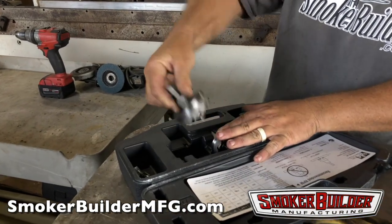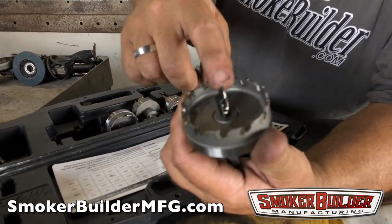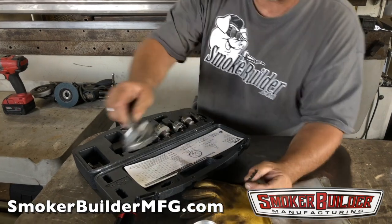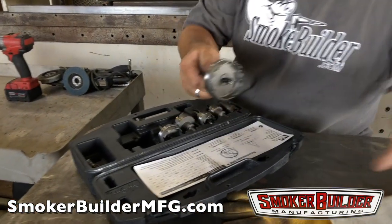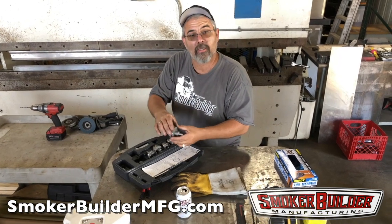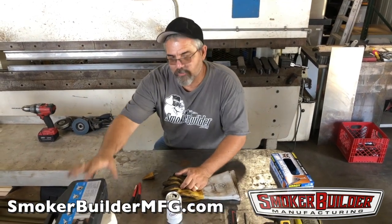These electrician-style bits are expensive, precise carbide. The little spring will eject the piece of metal right out — it doesn't get stuck like it does in the less expensive bits. We recommend you drill a pilot hole first, because a lot of guys push really hard, the bit drops through suddenly, catches, and leaves a big skid mark across the side of the barrel. Drill the pilot hole first and just ease into it.